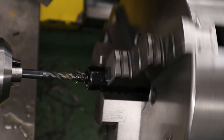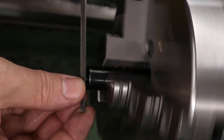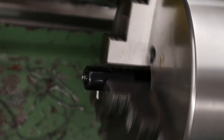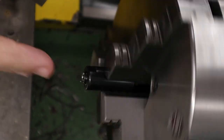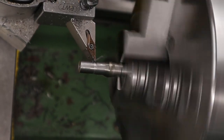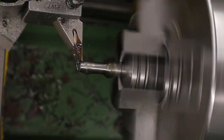I don't normally like modifying standard components — I'd much rather make my own — but in this case I didn't have a dovetail cutter on hand small enough to create the small dovetail which holds the cocking dog on. We could have worked around that if we really wanted to, but this one will be good for experimentation. We can play around with it and then when we remake it we know exactly what we need to remake.